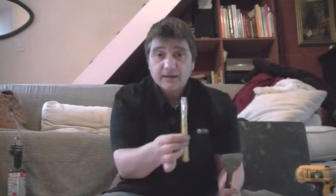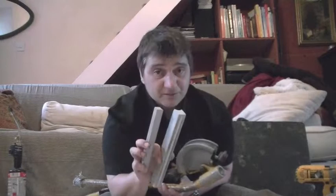A bolster chisel for taking up floorboards and a small stone chisel for doing stonework outside. I also always have a soldering mat so that you don't damage the floor, skirting boards, or wallpaper. A brush for applying flux, and a trusty tape measure. In the back of the van I always carry pipe benders — don't forget the formers, because the pipe benders are no good without the former.